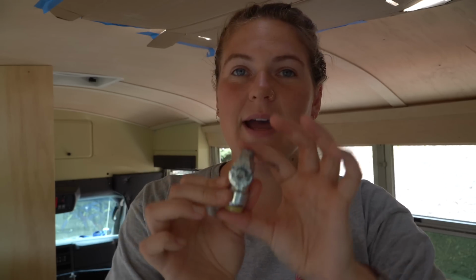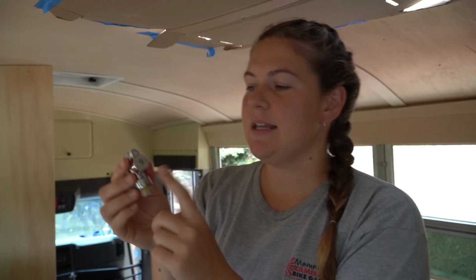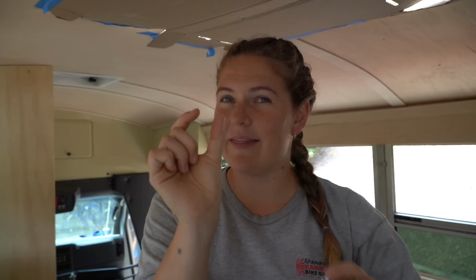In addition to that, I also was able to go to Home Depot and pick up the right part. I don't think you can see it. This is the valve that's going to go under my sink. What I had originally purchased was the 1/4 inch OD, and I needed the 3/8 OD, which is again the outer dimension. But I'm going to permanently install it now, get the rest of my plumbing hooked up, and wire it so that my pump works. And then it's time to test the system and make sure there aren't any leaks.